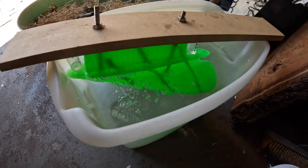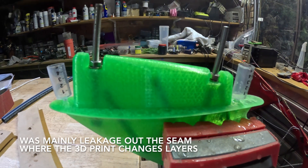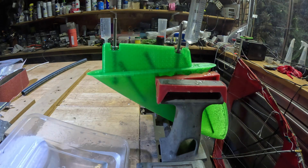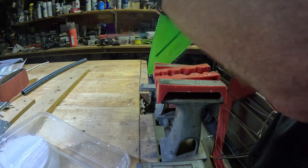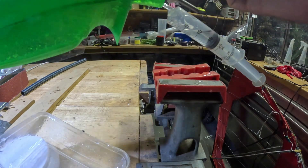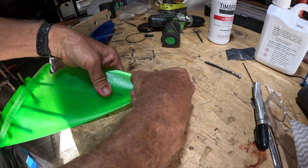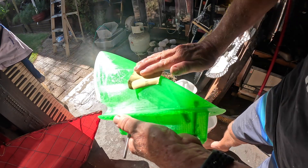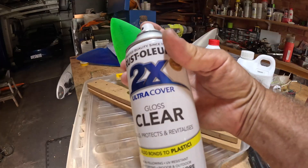My epoxy has a cure time of 12 hours, so the next day remove the syringes, which you can reuse indefinitely. You can see here I should have put more epoxy in the reservoirs as more air was trapped than I expected. Repeat the epoxy filling process for the tuttle — note you may have to invert the fin in order to remove air bubbles. The tuttle seems to be thin enough in my case not to warrant hanging in a water bath, but it still reaches around 50 degrees C whilst curing. Once cured, any drips can be peeled off the print as epoxy doesn't bond strongly to the PETG. I then sand, mainly focusing on the leading edge, to a 400 grit finish. I leave the remainder of the print unsanded or only roughly sanded as I'm led to believe the fin will hold better in the water this way.